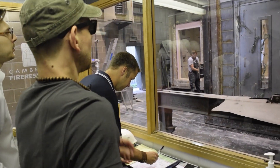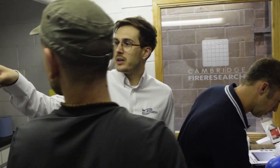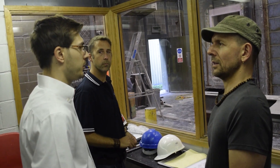And that is our double door. That's our door. What they're doing at the moment is they're putting on the thermocouples and that will monitor all of the radiation temperatures. If you see just behind here is a little screen — when the test is running you can see the temperature on each one of those thermocouples. They've got a monitoring room upstairs. They'll be monitoring it and looking out for if one of those thermocouples breaks or goes over the limit for the standards that we're testing to. And that's when they'll call a failure on integrity of the door.